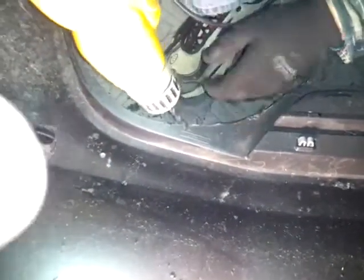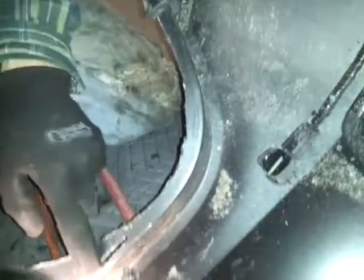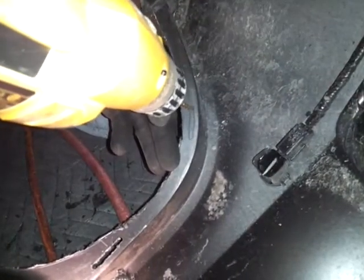Now these slots over here — I'm going to use a drill bit, it's 3/16ths — so I'm going to go ahead and drill that open. That's that slot done. I'm going to do the rest just like that and then file it a little bit to straighten it out. I drilled the whole slot on the other side and filed it down so it's nice and straight. For this one I'm going to use a 1/8 inch drill bit and do the same thing.